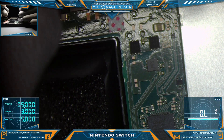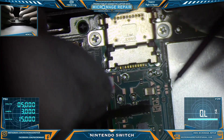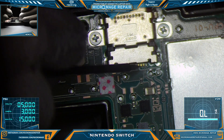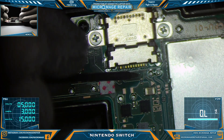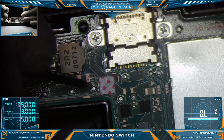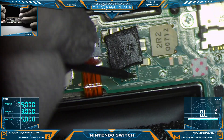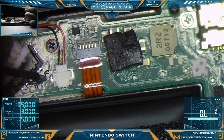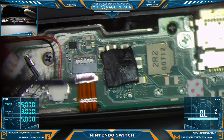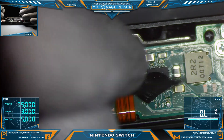Checking our little filter — everything around these MOSFETs seems okay. Now we're going to check our little fuse; that's fine. Let's check all of our lines. None of these should be short to ground except the one near the battery. The ones by the battery — that's the only one that should be short to ground. Moving this pad out of the way for a moment.